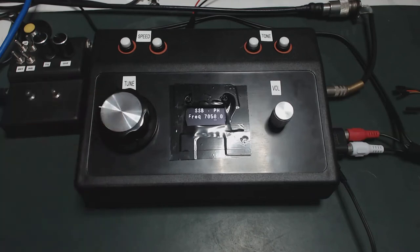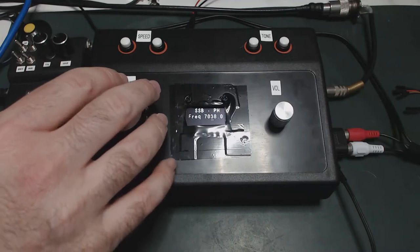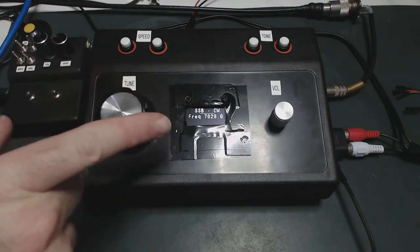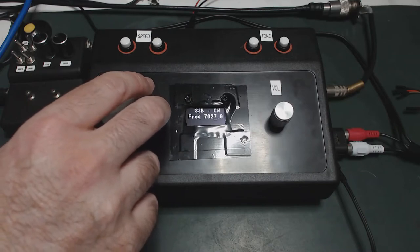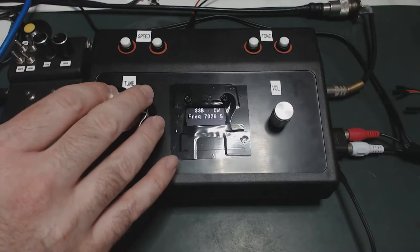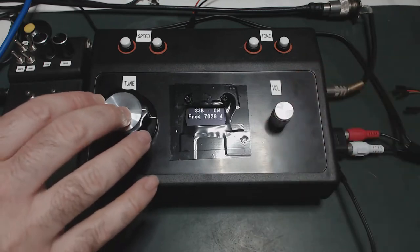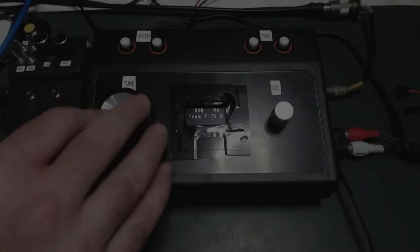So it's interesting now. You can see how the reception is working, okay? So, it's a very good reception. So let's play a little bit here. Let's move to the CW area, okay? To the CW frequencies. Look at that. I just changed my mode to SSB CW, and now you can listen. Somebody's transmitting in Morse code in CW. You can also make a fine tuning here, for example, in order to achieve a better tuning. Okay. It's just showing you how it works. It's really, really cool. Let's go back.